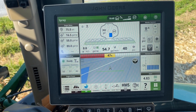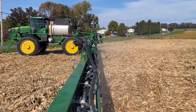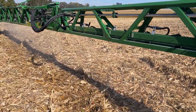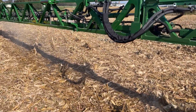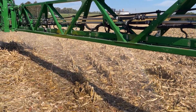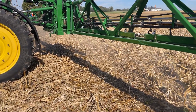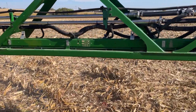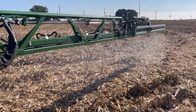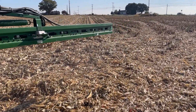We're going to go outside the machine now and walk along the boom while it's spraying to show some other features and advantages of an Exact Apply sprayer. We've got the machine spraying here, running a nozzle flow check — it's spraying at a predetermined rate and speed that we entered on the display. We can come out here and do nozzle checks, which is handy for seeing if you've got good pattern, worn nozzles, or to know you've got the right nozzle and speed for the rate you want to spray. Nozzle flow check is not just an Exact Apply feature — any John Deere sprayer has had that for a number of years. Also very handy for clean out.